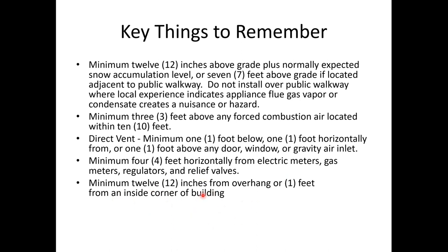Recirculation does some pretty nasty things to these products. A quick telltale sign: if you pull the flame sensor and igniter and they look brick red, that's a sign of recirculation. Another sign is hazing on the inside of the cabinet and brittle plastics. Anyone familiar with older condensing products — if you had recirculation, the plastic swirl plates would get destroyed. We want to eliminate recirculation — unfortunately on some terminations there'll be some, especially in low fire conditions or depending on wind direction, but we want to keep it to a minimum.